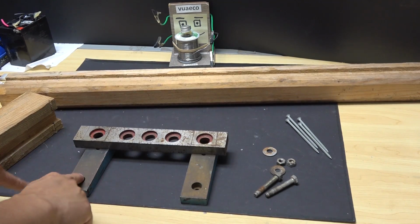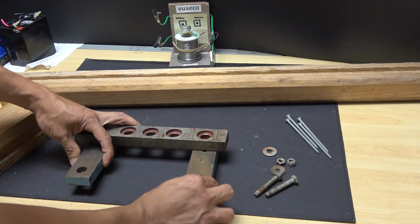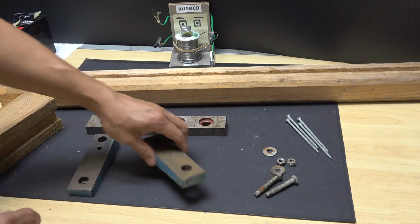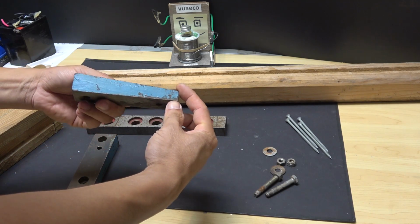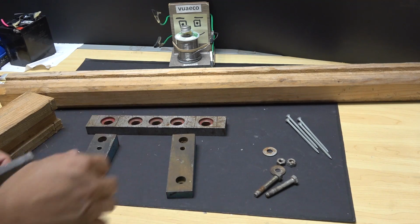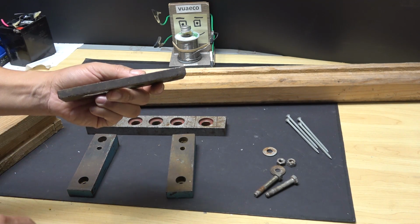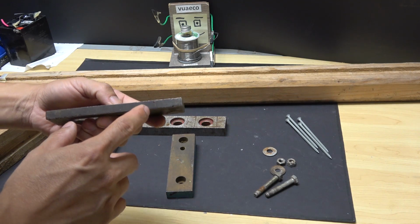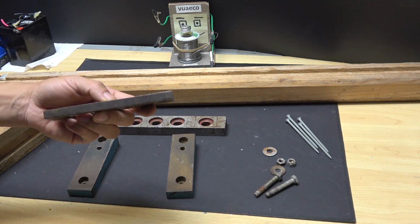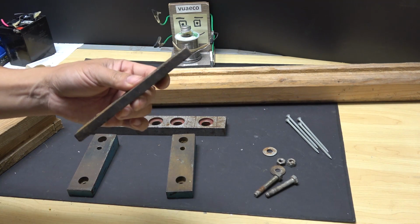So these two pieces of steel here on the bottom, this is what I use to pry up the wood on the pallet, and it's very important. This one is half an inch thick on this side and 1 inch thick on this side, and I made it before using 1/4 inch steel. It's not good enough, and it was bent when it was trying to pry up the pallet. So this is not good enough. It has to be thicker than 1/4 inch.